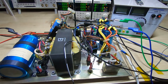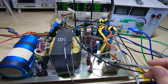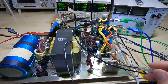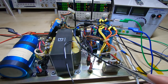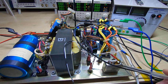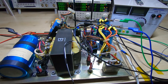I've also bypassed the filter on the mains input connector. The owner wants to retain it so I'm leaving it in place, but I'm bypassing it while testing. These have a habit of exploding — they're effectively the same type of capacitors found on other computer systems that can destroy themselves, and because this is a sealed box they tend to go off with quite a bang. When testing systems like this I always disconnect and bypass it. It's currently going straight through to my mains power block.